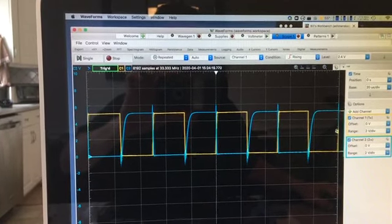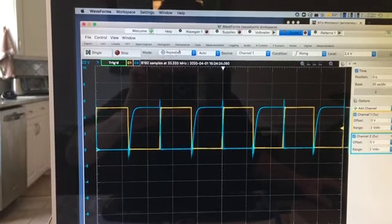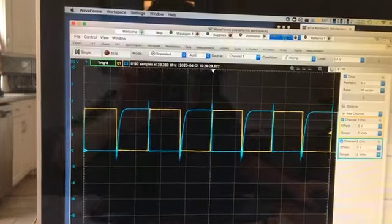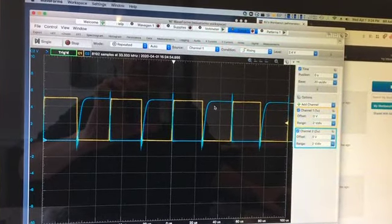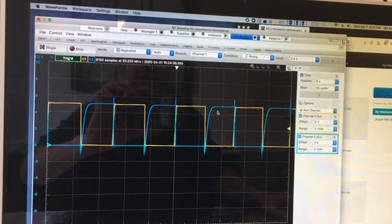And yeah, actually now you see, I think this is a little bit of unstable trigger on my scope, okay. Now you see at that same frequency, which was the 20 kilohertz frequency that was not working too well a moment ago, now this is doing a decent job. So instead of taking tens of microseconds to reach 5 volts, it takes only a few microseconds.